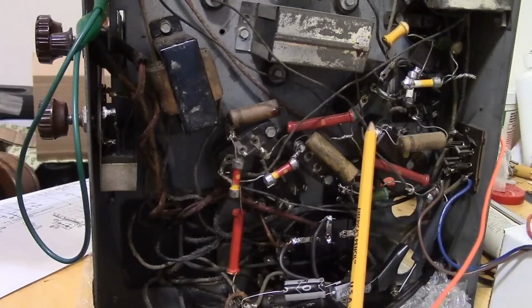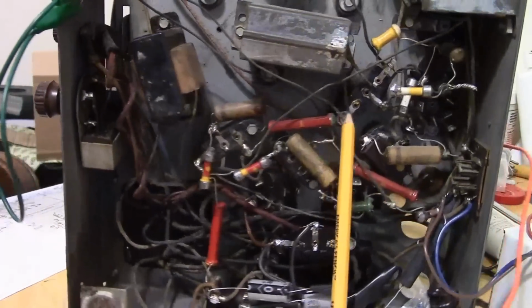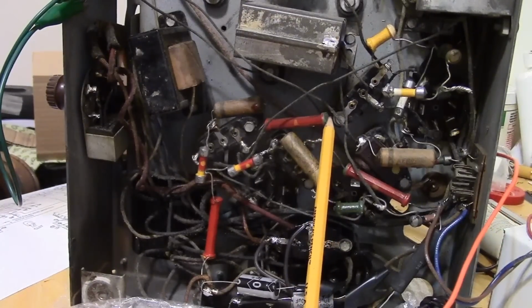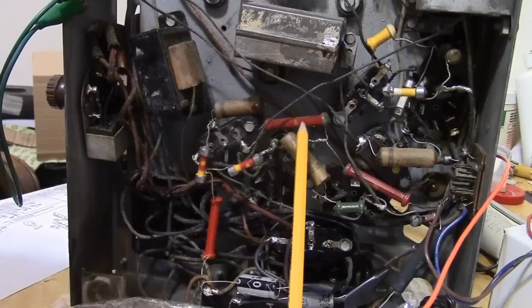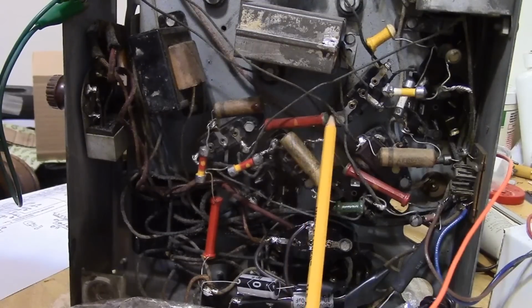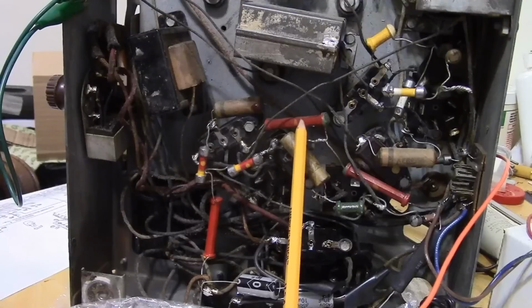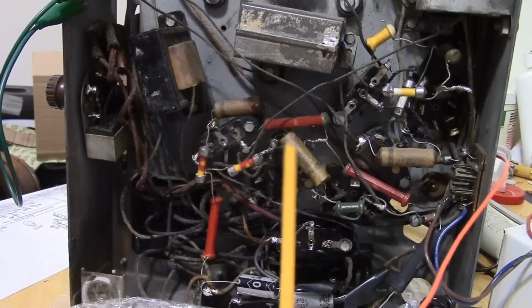So a little hard to see on this one. Let's rotate this chassis a little. So red, and there's a green on this end, and then an orange dot. So red is 2, green is 5, orange is 3 zeros, the third is the multiplier. So 25,000. It's a 25,000 ohm or 25 kilo ohm resistor.